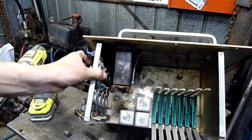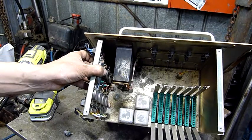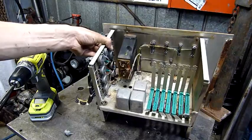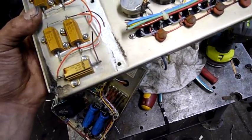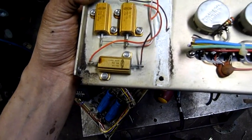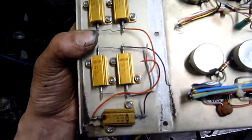Let's do a couple of close-ups and that should conclude this one. I'm going to grab the analog meter, but most of this has been water and rain weather damaged for quite some time, so it's really not worth salvaging. Some nice 10K and 100K potentiometers — they're still okay, they haven't been rained through. These resistors are 10 ohm 25 watt, 5 ohm 25 watt, and 8 ohm 25 watt. They're metal-cased heat-sunk resistors, so I'm going to be keeping every single one of them.